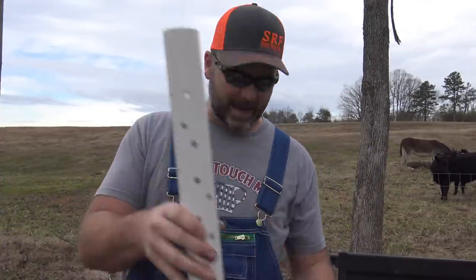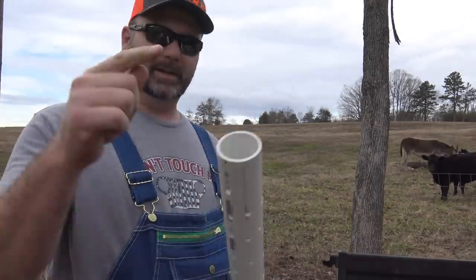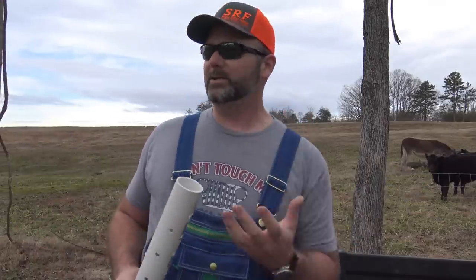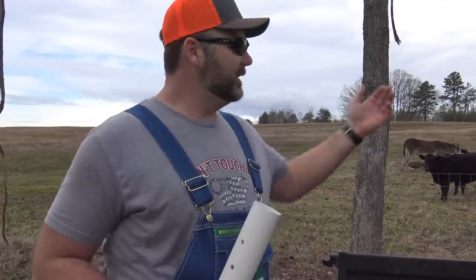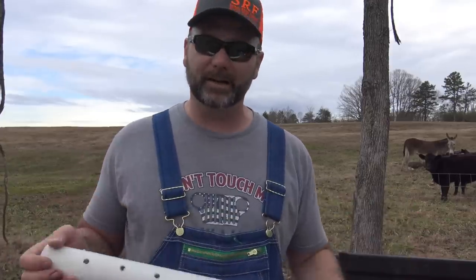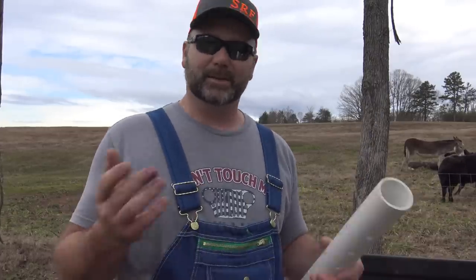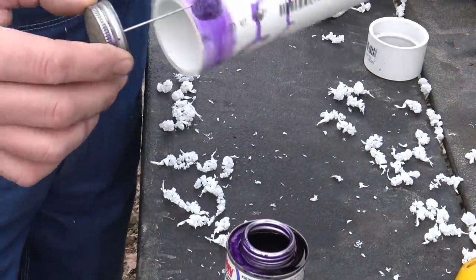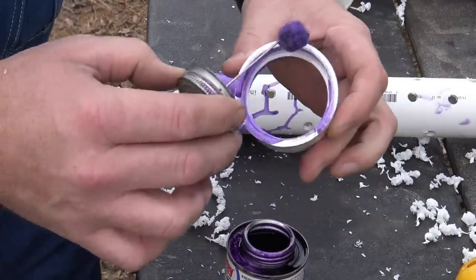We're also going to blow it out and knock out any little trash in there inevitably. Now we're going to put the end cap on and the connector for our three-quarter inch poly. The whole job here is probably only going to take about 35 minutes and we'll have a water system down in the other field for the cows. This is a temporary setup for a permanent solution — right now we just have a few cows so we're doing a temporary quick setup. We're also going to prime the couplings and all the connectors to make sure everything's primed up good.